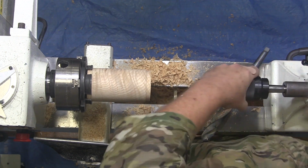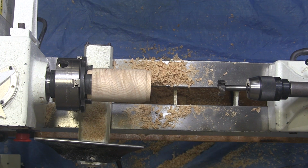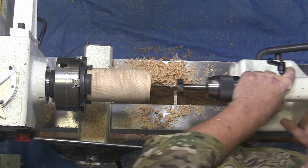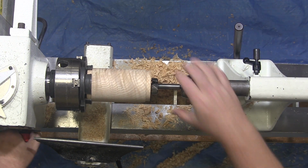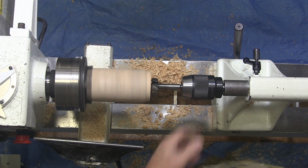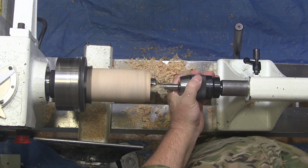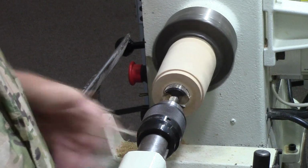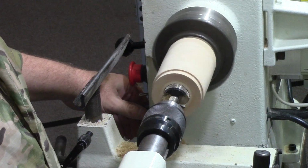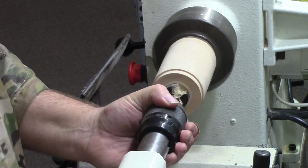Okay. Now I came here planning not to finish a peppermill, so don't think I'm going to go that long. We're talking about the hardest part of the peppermill. The rest is on you. Okay? So now, this is, I believe, a 1 inch and 3/8 bit. It could be whatever you want it to be. And you'll see here in a minute when I show you on the cap. Okay, remember the heat. I'm a little fast. For this size Forstner bit, I'm at 426.